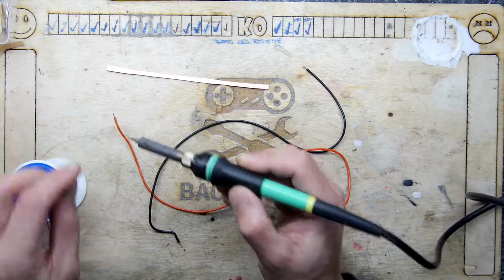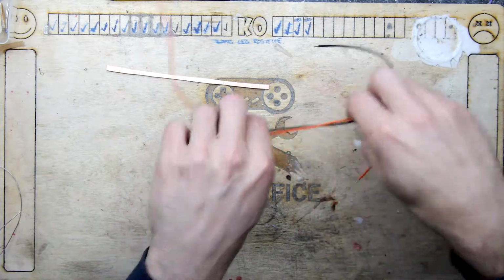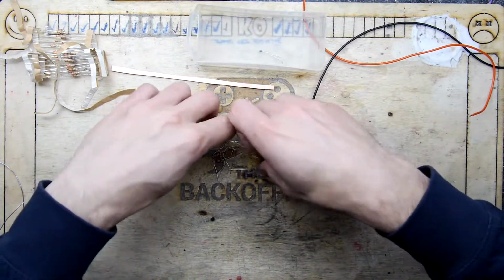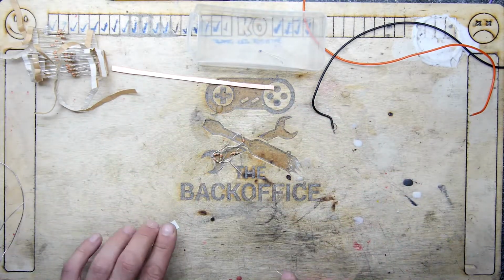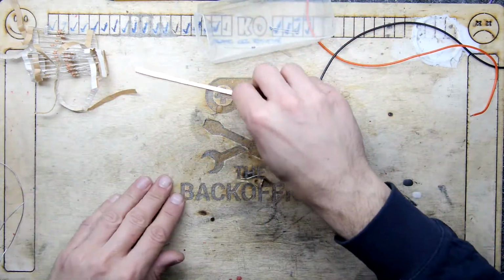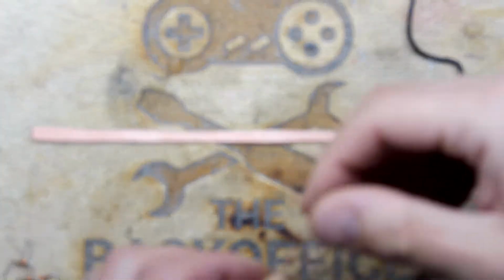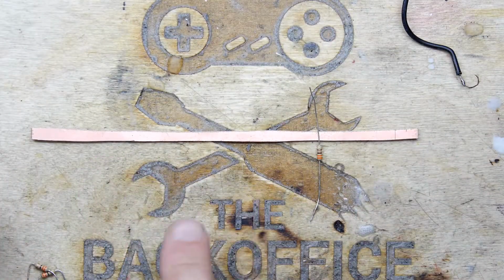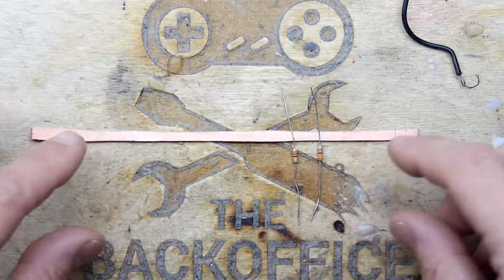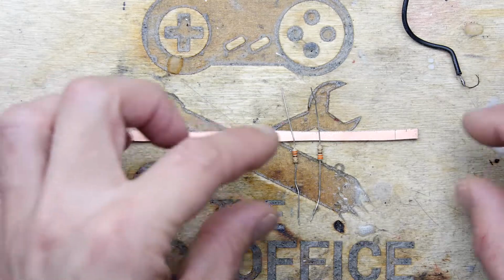Those are actually quite flexible, because they build the resistor ladder, like I described last time, but they build them in a strip. I'll show you with some of these bits I have here. Imagine you get two pieces of sturdy wire, maybe some insulated wire, and you lay them in two parallel rows. Then you take the resistors and space them out to the required density, which depends on your power requirements, and you solder them to the two flexible wires. Then two power wires go on, and that's it. You put power to the rails, and they illuminate.